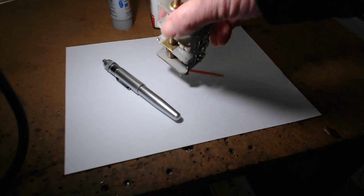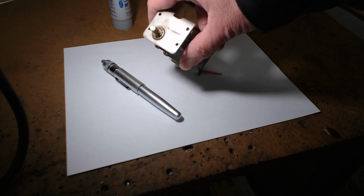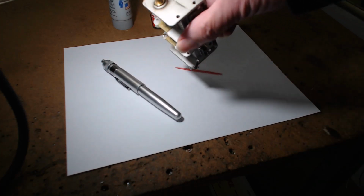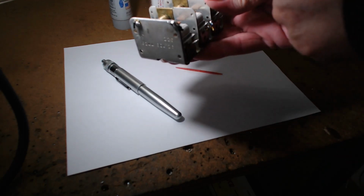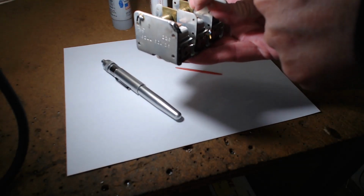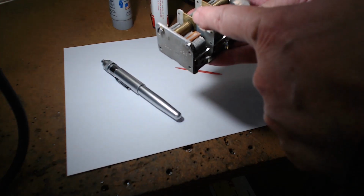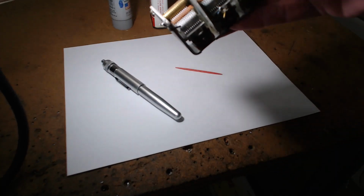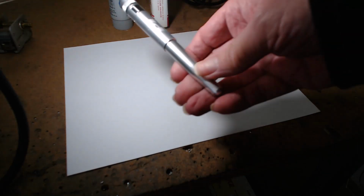Now, when you look in the end from the shaft on the units in the command radios, you'll see ball bearings in there, and one simple drop of oil goes in there. Go along in here, you put one behind there, where more ball bearings are, each pivot point or bushing. Then one in the back. Of course, in the radio this is mounted, so it's nice to have a precision oiler, and that's what I went and bought.